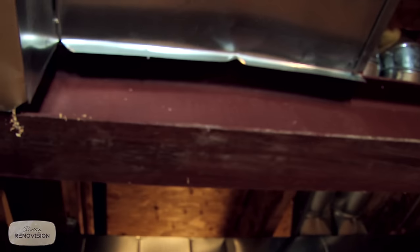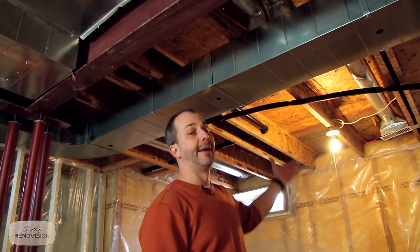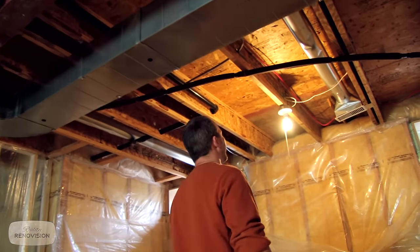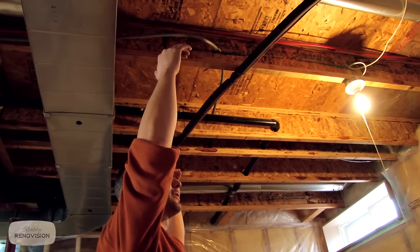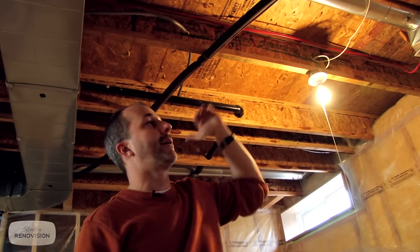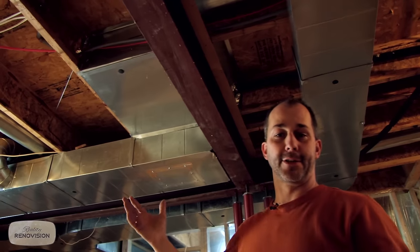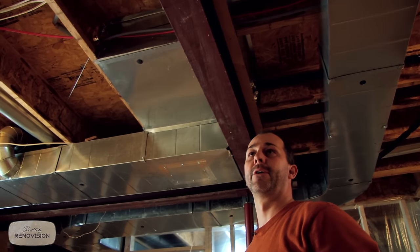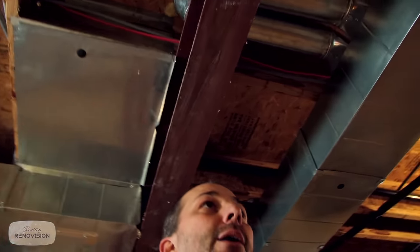There are a couple of things we have to overcome: steel I-beams, ductwork, and of course plumbing, wiring, and air conditioning lines. This A/C line comes right through the area where we're going to put our theater room. On this half of the bulkhead we're going to have to strap the ceiling an inch and a half using a solid 2x4, then we can put in our drywall. The rest of the room we just go back with some 1x3s, 16 inches on center, for plenty of screw surface, and all the remaining beams will have to be covered in drywall boxes.